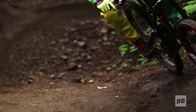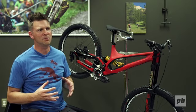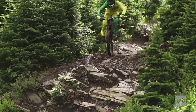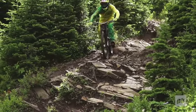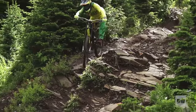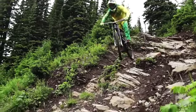When it comes to wheel size, we explored everything. We think for this platform today, 650 is the best because it gives you a balance of the lightweight and quick wheel response, and also allows you to package the rear wheel in a short chainstay. Going significantly bigger than 650 makes it almost impossible for your saddle to clear the tire at bottom out.